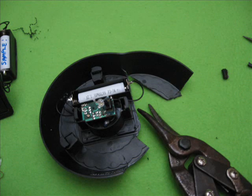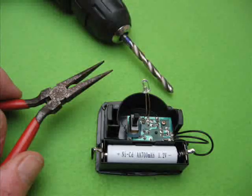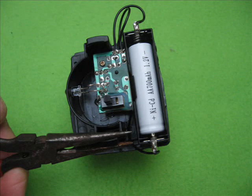We'll cut around the lamp and snap off the unwanted pieces. This isn't too difficult. When you finish, the kids can sandpaper over any sharp portions. A 5mm hole will need to be drilled for the LED, and with pliers this can be neatly bent over and put through the hole. Snap off the little wings just above the LED.